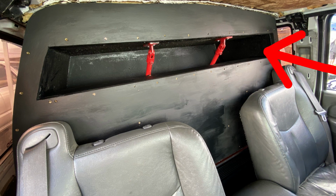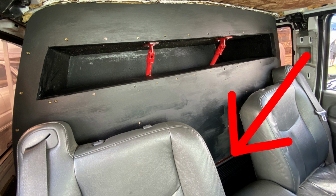So if you notice the way the port layout is, I like that it is fourth order, so it gives you a little bit better, broader bandwidth, and being a 2-to-1 ratio, helping a little bit with that SPL peak, and having the top port so you don't have to worry about headrest issues.